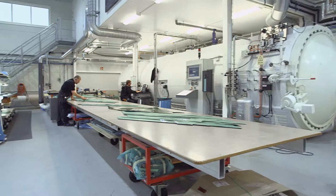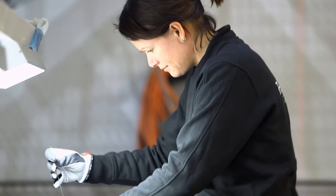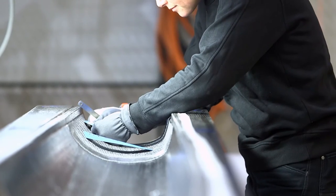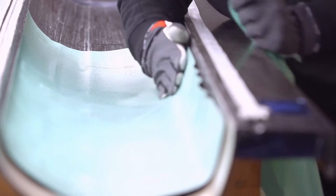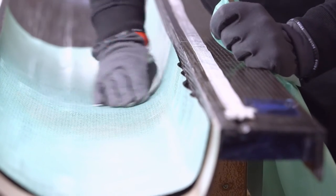The other components like the beams and the traveler track — which is a track that controls the sail — are produced from single laminates, solid laminates of up to six millimeters thick made of multiple layers of carbon. Each of the layers is about 0.3 of a millimeter thick, so we need lots of layers, and for that to work we have to really press those layers together.